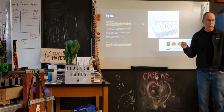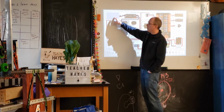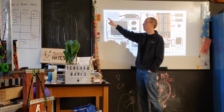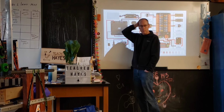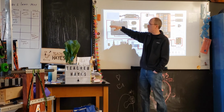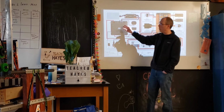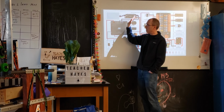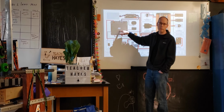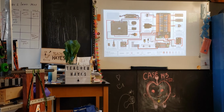What happens in that overall diagram, though, that you should note is that usually this will come up first, and what will happen is you'll connect your computer to this. So this is just your Wi-Fi talking to whatever it is, our team number? I don't remember what the connection is. You'll connect to this, but that just means that your computer is talking to this. It's not necessarily talking to the National Instruments yet. So what often happens when you turn on the power is nothing's working at first, then this boots up, you connect to this, but this isn't up yet. So until that's up and you get software on it, do you have something that's running? So all those things sort of have to work in sequence before you can actually make anything happen with the robot.